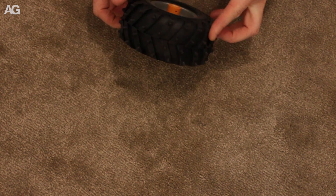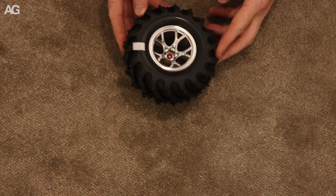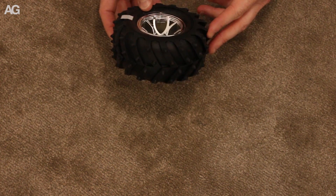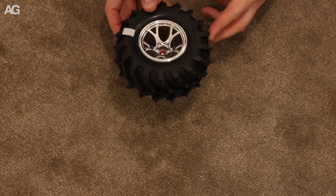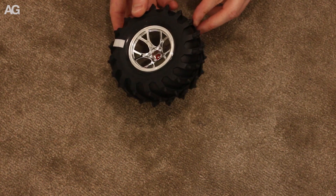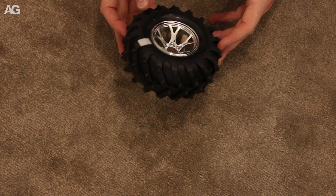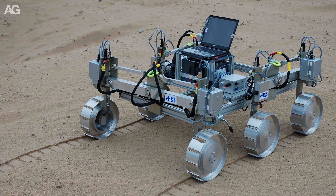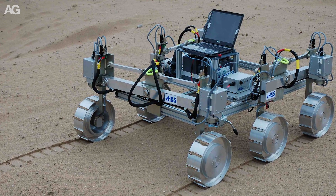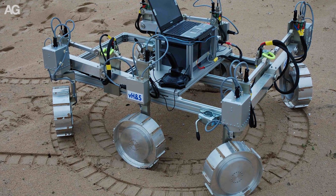As a starting point I found these kind of off-road RC vehicle wheels. They're fairly decent and do the job for this. I've also decided on having six of them — six wheels. I've been looking at various different suspension systems and I've opted for the design used for the upcoming European Space Agency Mars Rover, just because it's fairly well known and fairly easy to make. But to do that I need six wheels that will pivot on the spot, which allows for a tight turning circle without dragging the wheels on the ground.